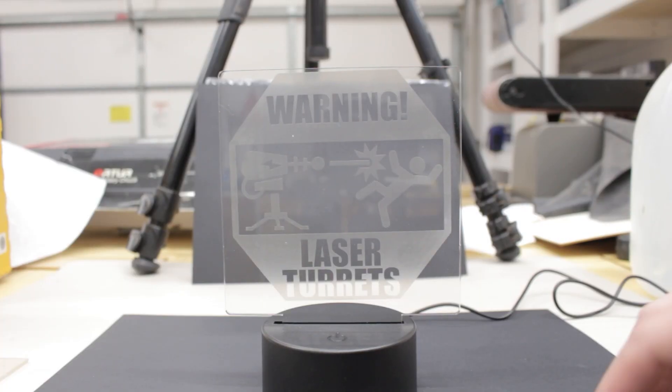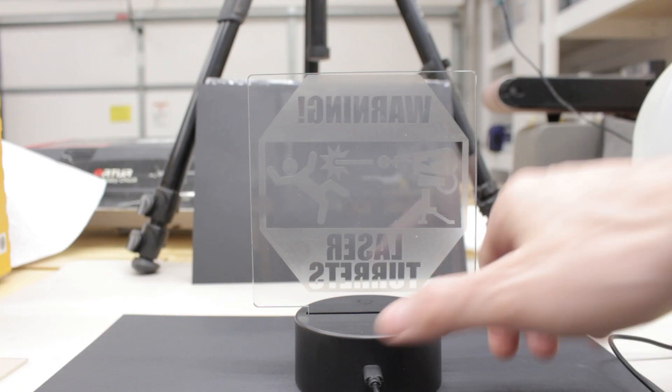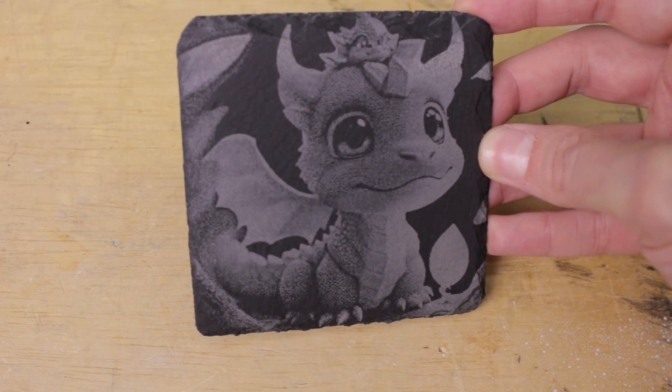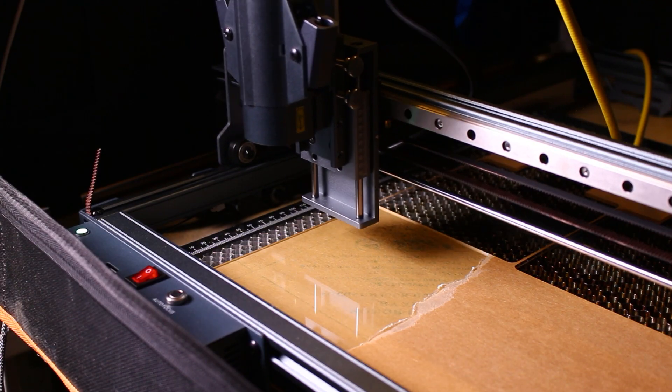So what is each laser type good at cutting and engraving? Both diode and CO2 lasers are great on organic materials such as wood and leather. A diode laser can cut and engrave some acrylics if they are opaque enough, but will not cut clear acrylic — though you can engrave clear acrylic with a diode using a simple trick. I'll leave a link in the description to my video on engraving clear acrylic with a diode laser. If you want to cut clear acrylic, you will need a CO2 laser — the same goes for engraving glass. While both diodes and CO2s can mark on some metals with preparation, a fiber laser is the way to go if you want to deeply engrave metals. All three lasers can also work on slate, which is a really popular material. A drawback to fiber lasers is that they won't work on wood, clear acrylic, or most organic materials.